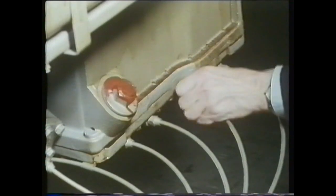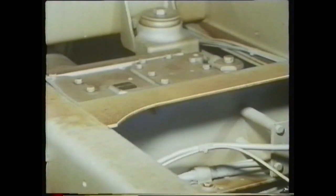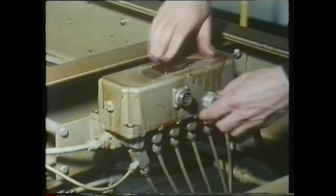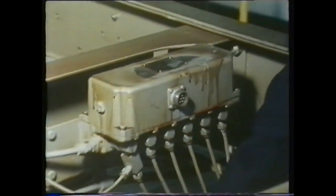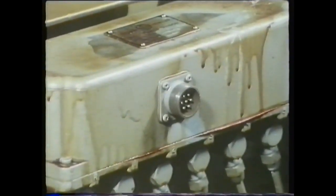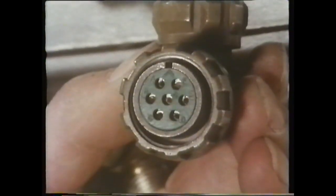However, if there is no air escaping from the pipe outlet, it means that there's a fault in the control system. Therefore, first replace the air inlet pipe and proceed to examine the control system in the following manner. First, disconnect the plug that takes the electrical supply from the change speed unit to the entry point of the EP unit, and examine this socket for any sign of dirt or corrosion that will prevent a current flow and cause a malfunction. Examine also the plug for the same reason.